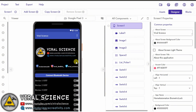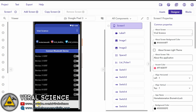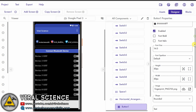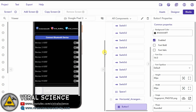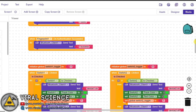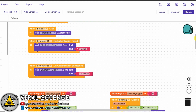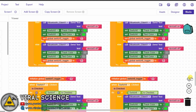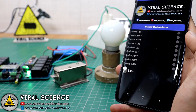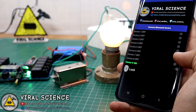To combine this project, I have made another application which integrates home automation as well as the fingerprint lock. I have added 9 devices to be controlled and 1 fingerprint lock. You can get all the project files and the application file from the link in the description. These are the programming blocks. Download this application, install it on your smartphone, pair it with the HC-05 module, and you can control the bulb as well as the lock with your smartphone through Bluetooth.